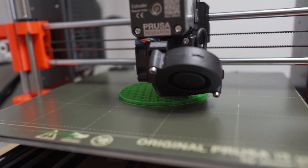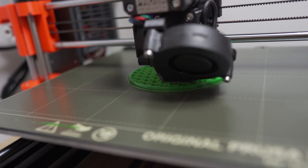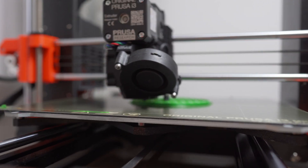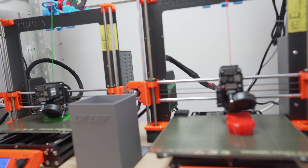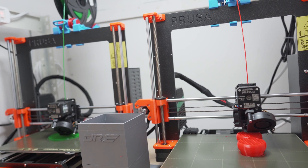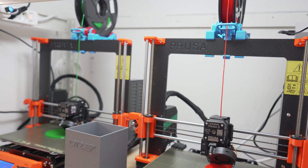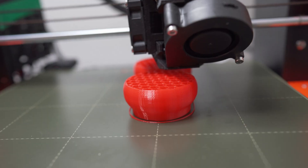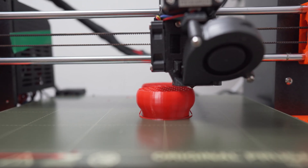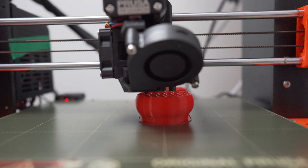This spool holder will allow you to use a ball bearing spool holder. I made this so I can use TPU material without any clogging, so the filament is fed to the extruder with no restriction. I've been able to increase my TPU speeds from like 20 or 30 millimeters per second to 200 millimeters per second, and also increase my maximum volumetric speed from 2.5 to 8 millimeters cubed, which practically means I'm now getting the same speeds I was printing with PETG.